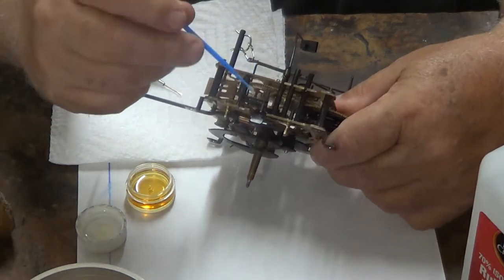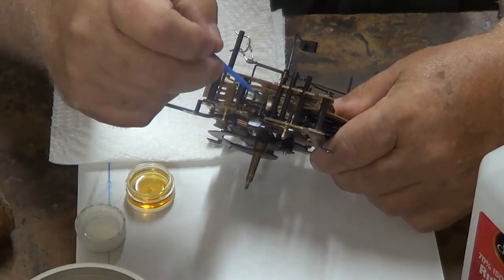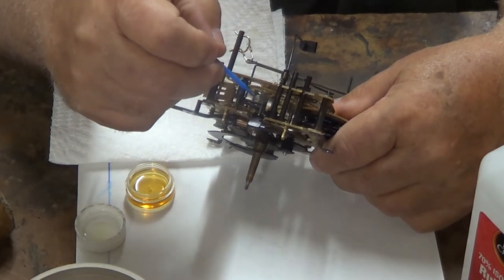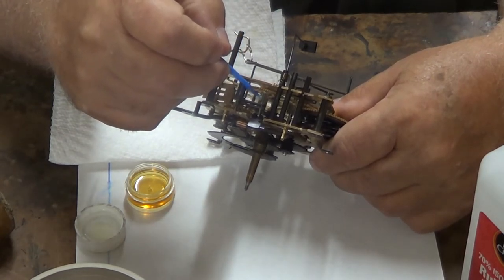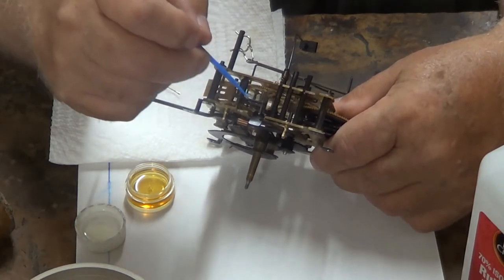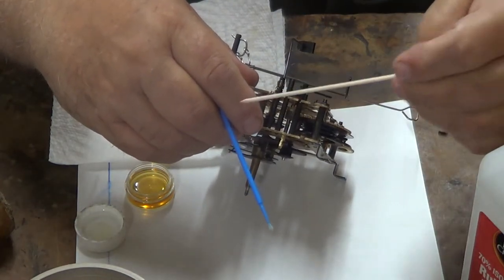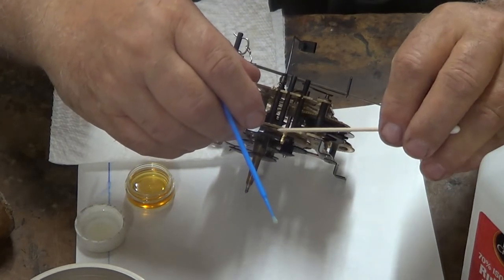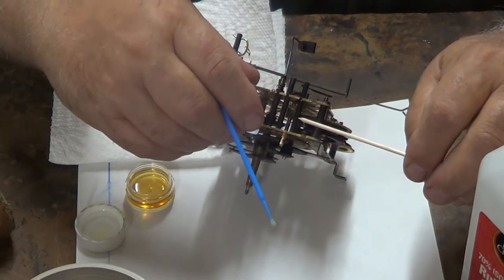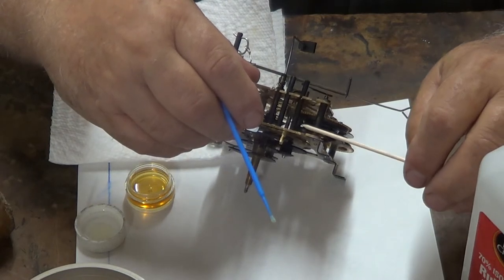Inside here are all the cog gears. I'm looking at the video trying to monitor, trying to tell you. All right, these right here. Those little gears in there collect a lot of grease. So the thing you want to do is come in here with your little pointers on your cleaning swabs, and scrape that off. It takes a while, so don't plan on taking your cuckoo clock out and just quickly oiling it, because it's going to take longer than that.